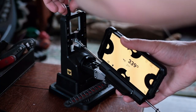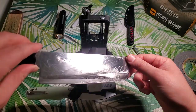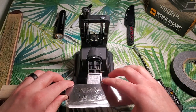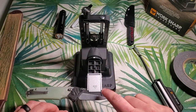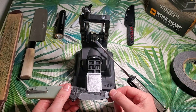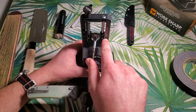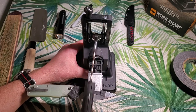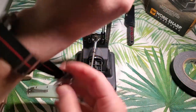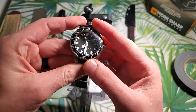Of course this is not going to be a hundred percent accurate — if you want complete accuracy, get an angle measuring app on your phone or a clinometer. A wider knife like my Nakiri will show a shallower angle since the edge is farther out, but it will still make for very repeatable results on the same knife. I'm going to go at 17 degrees at least according to this gauge, and I'll set a timer here to see how long it takes.